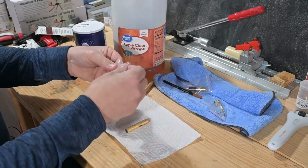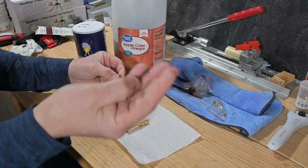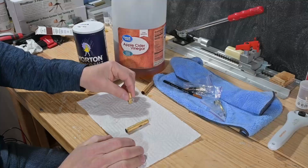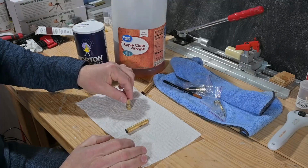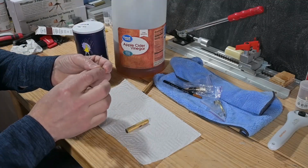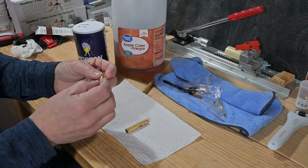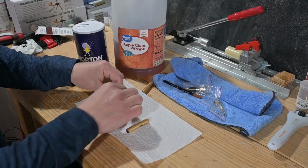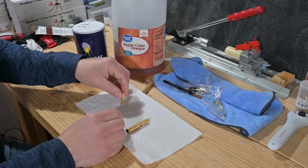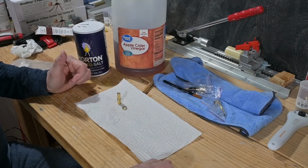But this time when I do the parts for the pen, I'm gonna set the parts, spring, don't lose your spring, in the container on end, and when I put it in the oven, I'm gonna put it in the casserole dish on end like that, because these ends right here, if they do get that little rust color, I can sand it off before I put it in there, and if it shines up a little bit, it will. And then that way, you'll never see that part. So all the parts that are gonna be pressed up against the pen blank or inside the pen blank are gonna be resting on the kit that way. And then we're gonna patina this all up.